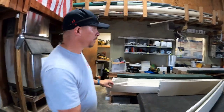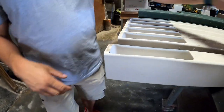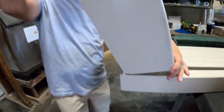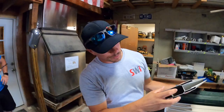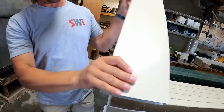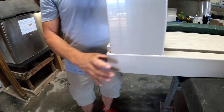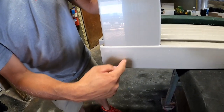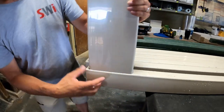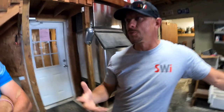What he's going to do is put those pieces they've already cut in here, and they cut out the little piece that will fit all the way down inside, just like it normally would. This also has aluminum in it, two different pieces of aluminum. They route their holes tall, so we've got a little bit extra room. If the gates rack, they'll put one screw in here, and then the crew on the job site will add the other three screws after they rack it to the correct opening. Do you have a template to get all those screw holes in exactly the same spot? You just put a hinge on there, and then it's perfect every time.